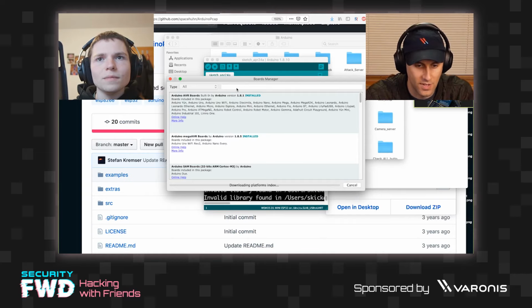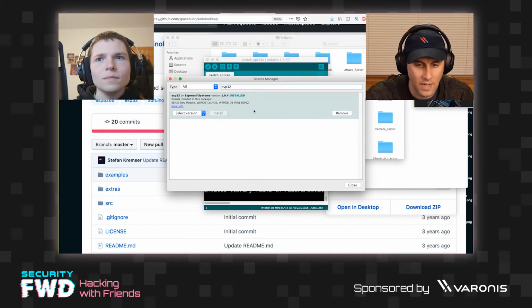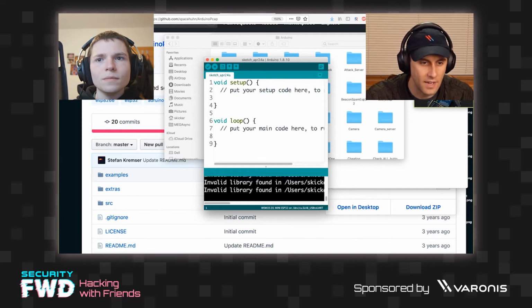So as soon as this finishes downloading, then I can type in ESP32. And this is the package you guys need to have installed in order for these boards to show up in Arduino. You'll be super confused as to why they're not showing up if you don't have this. So once it's installed, you can go ahead and in Tools, when it again eventually opens, select the correct version of the ESP32 chip, and it should even auto-select the port. But if it doesn't, then you can just locate the serial port and then put it in there in a minute.